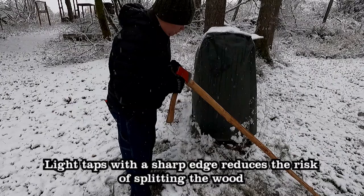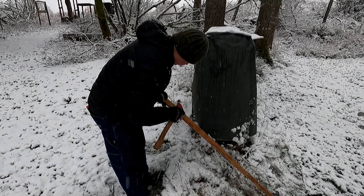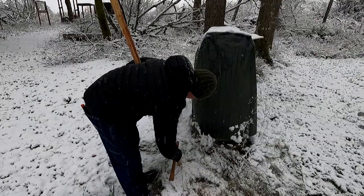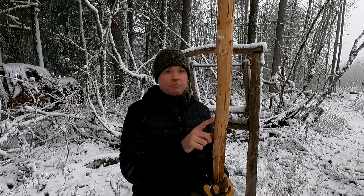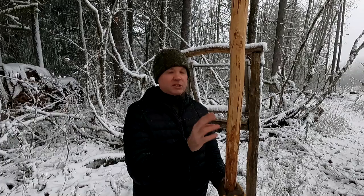You want to be careful not to cut too deeply into the wood because that's going to make cut marks. Removing those knots will help facilitate the next step, which is going to be removing the inner bark. As you can see, there are a lot of dark spots here — that's the inner bark which was not removed initially. It's completely subjective; you can actually leave that on and just seal it as is, but I'm going to be staining this wood and I like the look of the wood grain, so I'm going to go ahead and remove that inner bark.